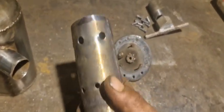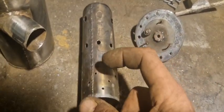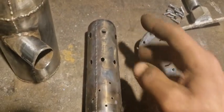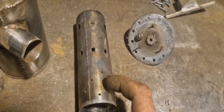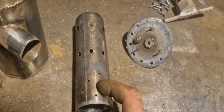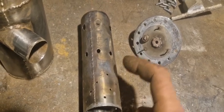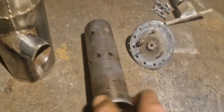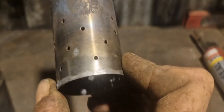An annular combustor shell — most of them will do 20%, 30%, and 50% air addition. They do that because the lower part burns really slow and really rich, and that means that the flame is not extinguished by all the airspeed. And as you can see it's getting hot enough, but the bottom centimeter never gets any significant temperature.